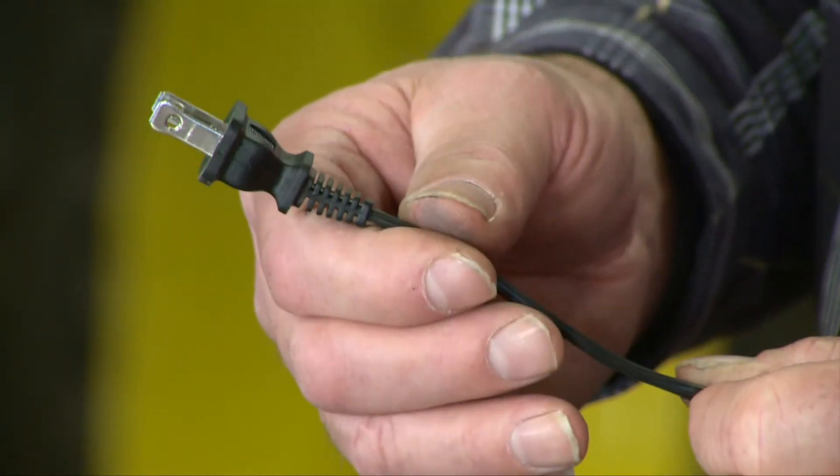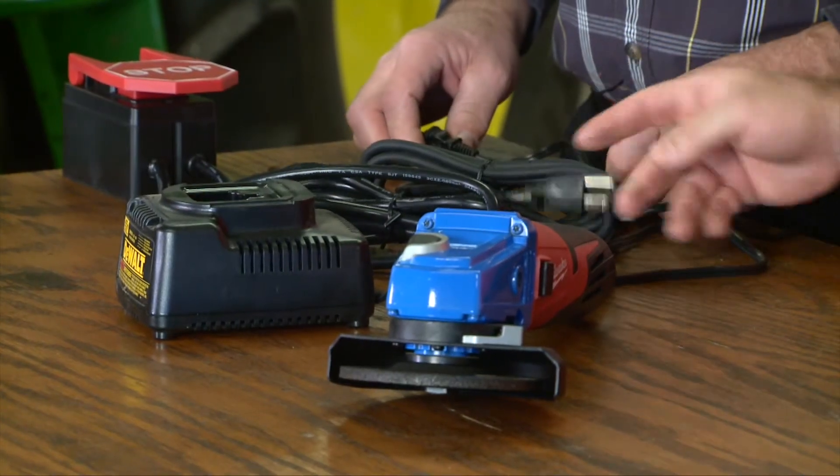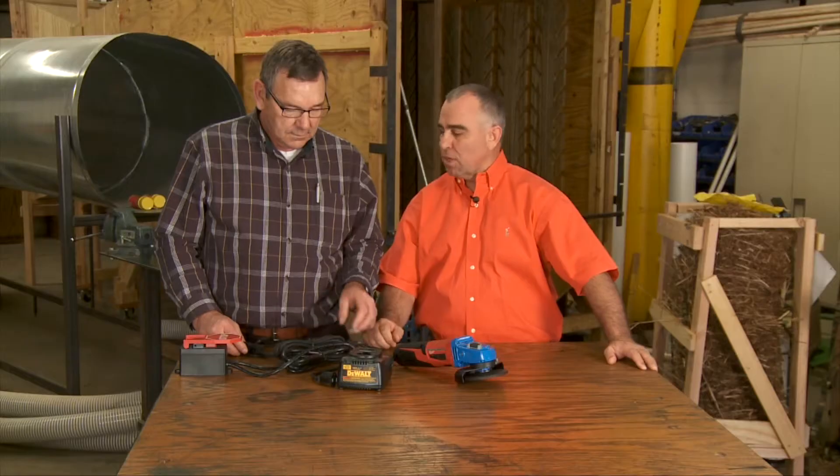So then you could reattach a new plug to it. If you've got the plug with the ground on it, it's only going to go into the outlet one way, and the ground plug is going to dictate which one goes into the neutral slot.